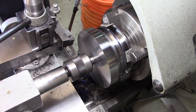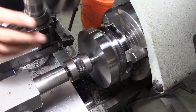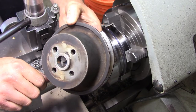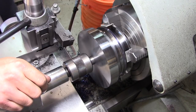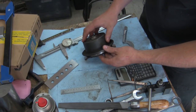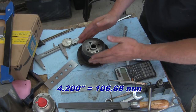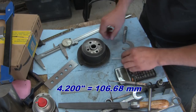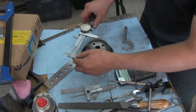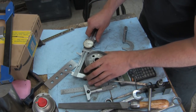So yeah, that's basically what I have to do to bring this down to roughly a larger diameter on this taper. You don't want to watch me do all that. Before I've roughed down, I still have whatever it is, 4-inch 100 thousandths, 4-inch 200 thousandths, something like that, on the outside diameter of the parallel turning I'm doing for roughing. Now, as far as the diameter I'm going to, my target diameter is going to be right about the same as what we have here.